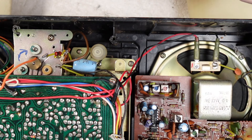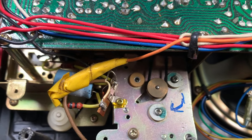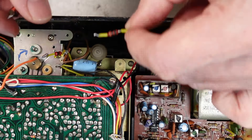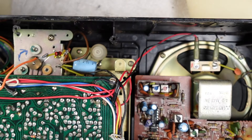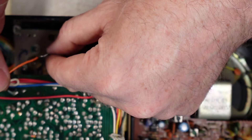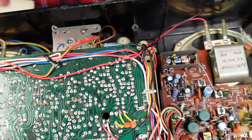I've just buttoned it up and was giving it a quick power-up test before bolting it up properly, and it was running intermittently - the tape was cutting in and out and then just wouldn't play at all. Checked all the leaf switches and everything was working okay, and then I went back to revisit the mess the previous guy had made - all covered in electrical tape - basically they'd put a resistor in series with the existing original resistor. It turned out there was actually a fracture in the original resistor. So I've taken all the old bodged wiring out and replaced it with an identical unit from my donor board, soldered that in place, and covered it up safely with heat shrink. Much better repair - it's actually fixed now and it's solid, safe and much neater too.